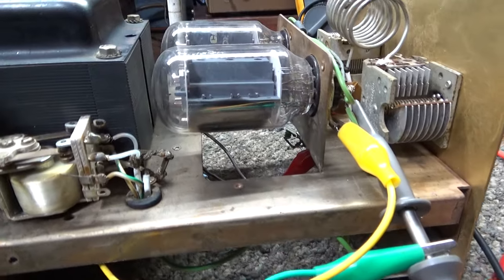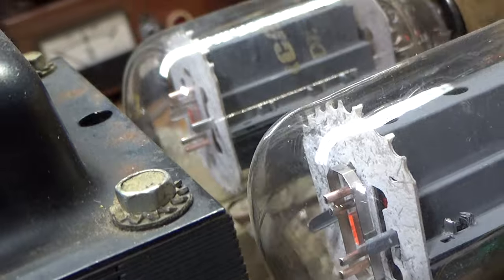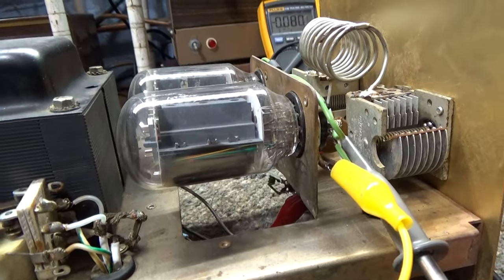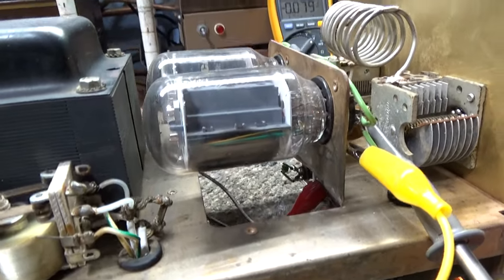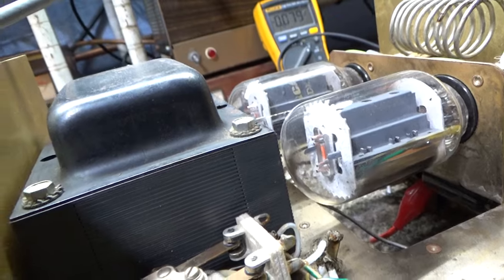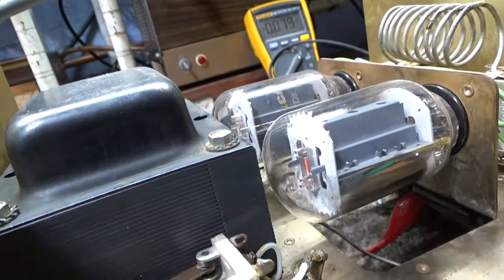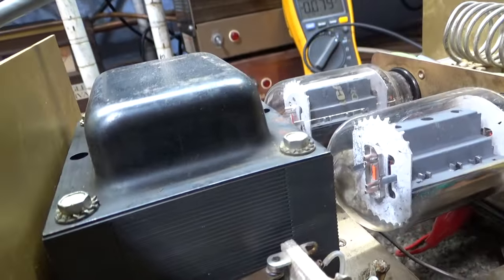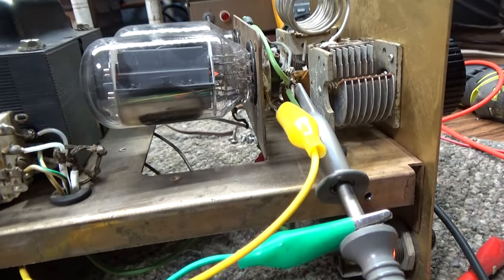You also have the filament, which comes from the power supply. If the tubes are lit up with that nice orange glow, you have your filament. If they're not lighting, you're missing filament voltage somewhere. Often with one or multiple tubes not lighting, it's a dirty socket or dirty tube pin not making a good connection. If you see multiple filaments out, they might be in series like Christmas tree lights — one goes out and they all go out — usually a dirty socket or tube pin.